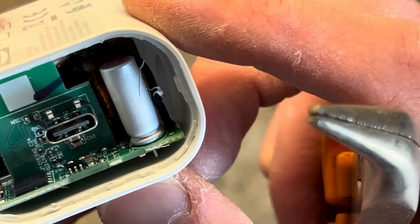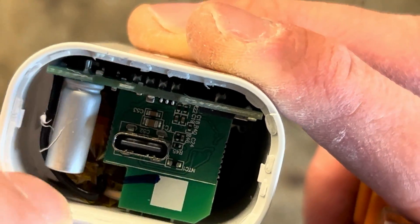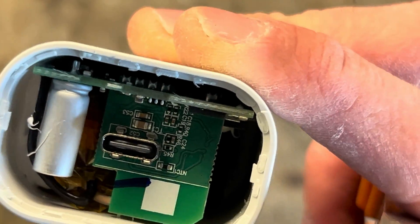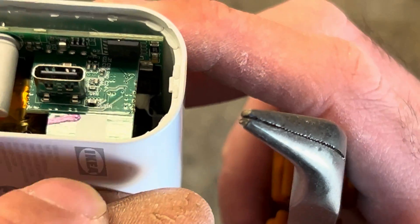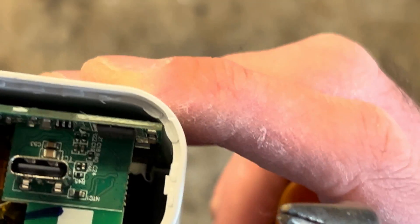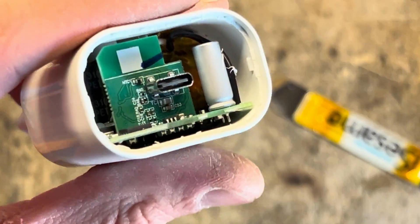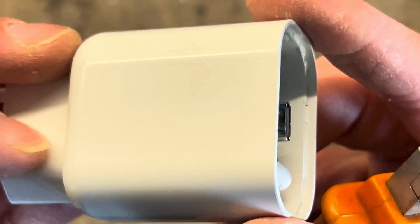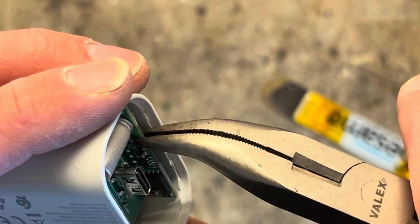I don't think there are pins going through both boards — you can see it right here, it's just the board going through and soldered in, which is not super confidence-inspiring. We have a big switcher MOSFET here, which is probably to enable the output. There's an NTC labeled here, which is nice — so that's some protection on this connector. It may have some more intelligence than the 3-euro charger. So at just 6 euros, it's not really that expensive compared to others.